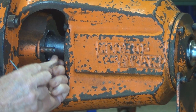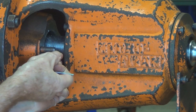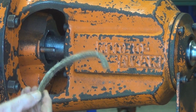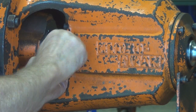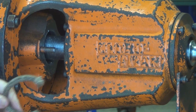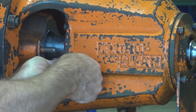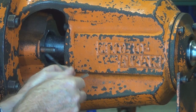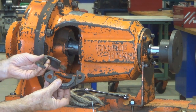The packing is made up of hemp, cotton, or flax woven together and impregnated with a good lubricant or grease so that when the shaft is rotating, friction is kept to a minimum. When the gland nuts are tightened up it compresses the packing, forcing it against the shaft to seal water, and also presses it out against the stuffing box wall to stop water coming out through the wall. Manufacturers expect a small leakage through the gland and leave a drain hole at the bottom of the pump for that reason.